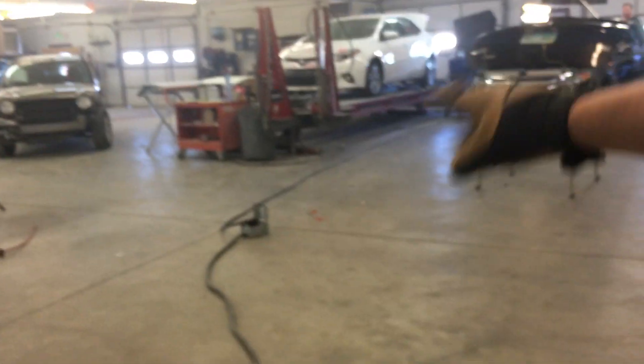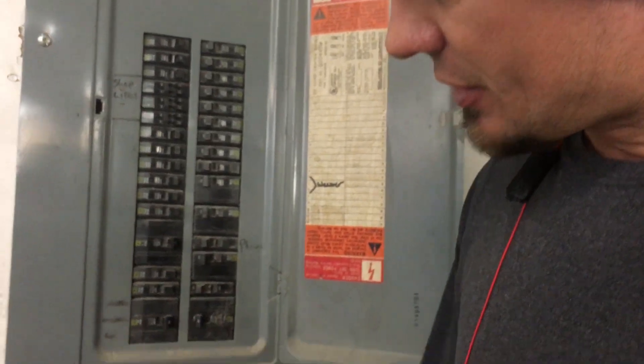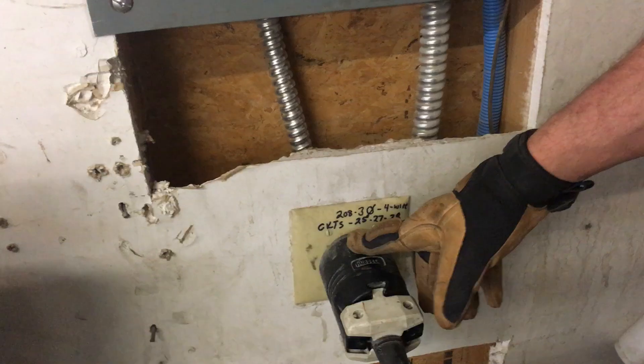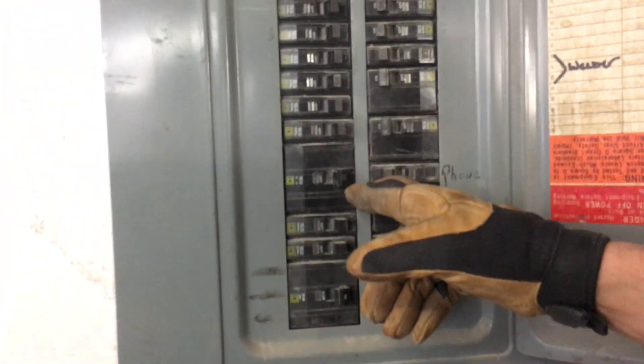We respliced that box right there — 50 amp cord. We have about a 65 foot voltage drop, and I'll explain that in the second video. This was unsecure and moving around. This had 8 gauge coming down instead of 6 gauge. The machine calls for 6 gauge, or 60 amp, and we have a 50 amp breaker feeding it.